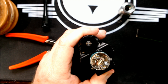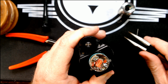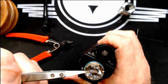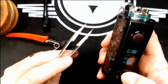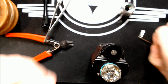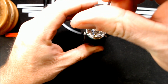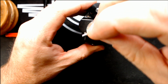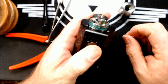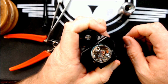All right. There we go. Nice and slow. There we go. And turn it up a little bit. Yeah, 0.19. That sounds about right. All right, now let's tighten these back down. So that's one trick. If you've ever had that happen where it was just too low, it wasn't burning in because it was too low, loosen your leads a little bit and do it again. Little trick that always works. There we go, 0.15.